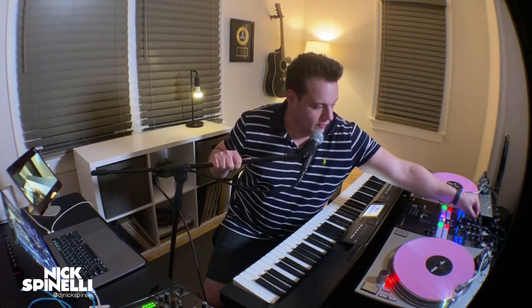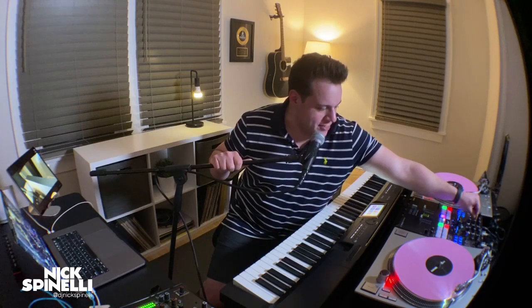As far as setting your volumes, a lot of people asked about that. I did a video about how to set your knobs, and I talked about proper gain structure. That's essentially what you want to do with all these mixers. When you're setting something, you start with it off. Can you guys see here? Essentially, you start with the volume faders off. You play a song, then you raise your gain up until you get to about yellow. Right when you hit the yellow, that's about where you want your gain to be.